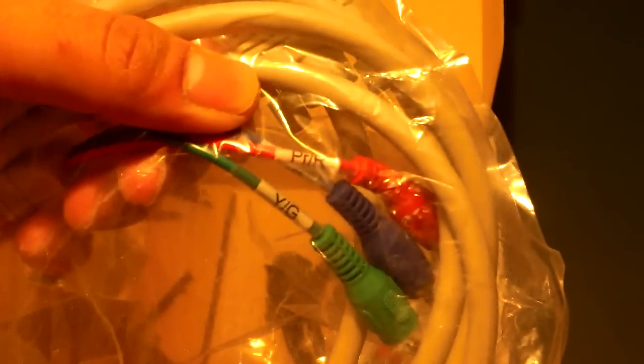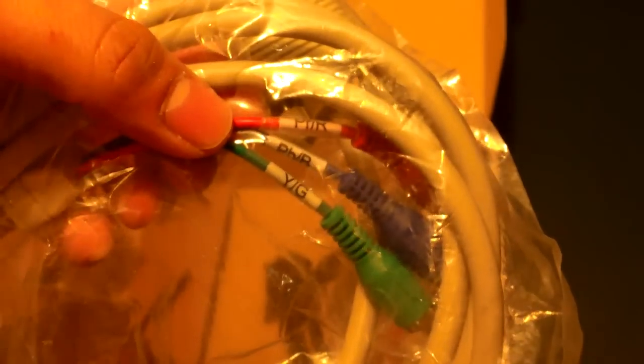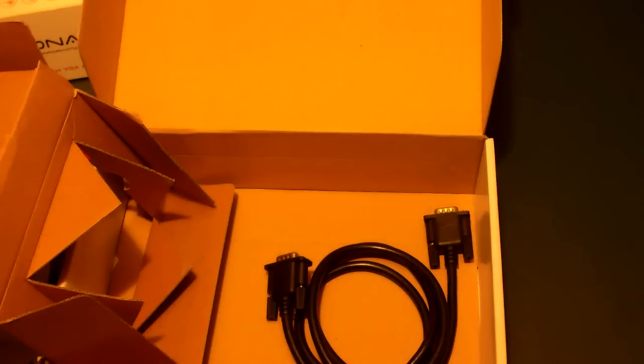This weird looking cable is a D-sub 15 pin male to 3 RCA green, blue, red male. The common misnomer would be VGA to component cable. And before anyone asks the quintessential stupid question, no, no, no. This cable alone does not simply convert a VGA signal to a component signal. It doesn't just magic. The HD510 converts either VGA or component to HDMI, but it uses the same 15-pin connection to save space instead of making the damn thing a little bigger to include RCA component jacks.